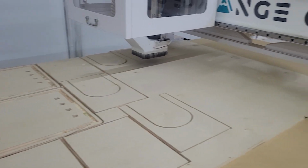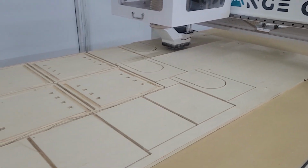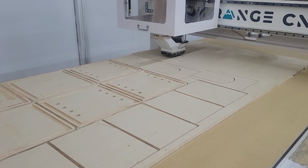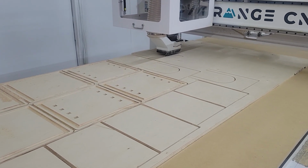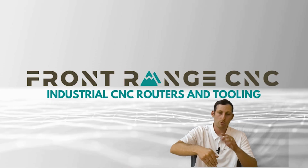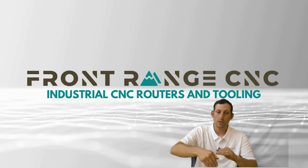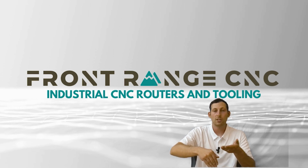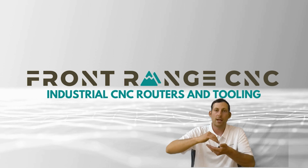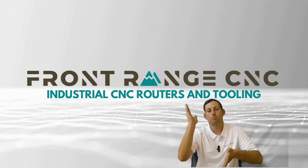And so the most important thing, if you are using a compression bit, is that if you are doing a ramp into your part, you want to ramp in pretty aggressively. That way you can engage the down flute on the top edge and the up flute of the router bit on the bottom edge. And in that sense, you have got your piece of plywood and you're tearing both edges inward, and that's keeping that tear out from blowing outward.